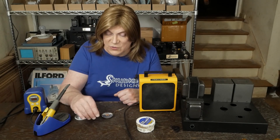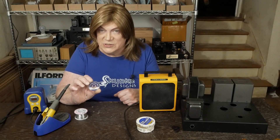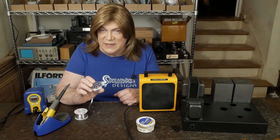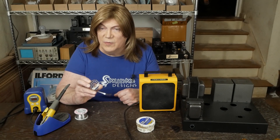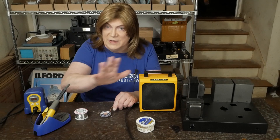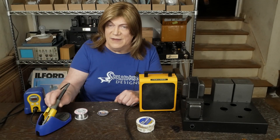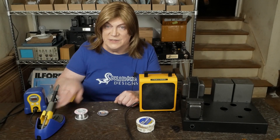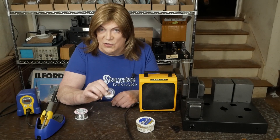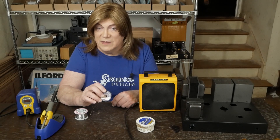The other thing I've had good luck with is copper desoldering wick. One of the tricks I've learned is you need to put a little bit of flux on it, or there needs to be flux nearby when you start the process. You also need to have a clean iron — we'll get to that in a second. A little bit of flux on the wick goes a long way to making it really suck solder out of joints when you make a mistake.